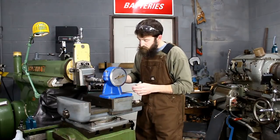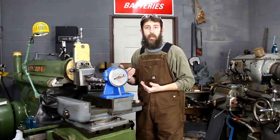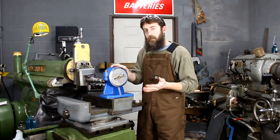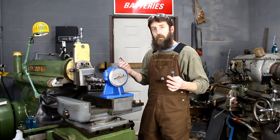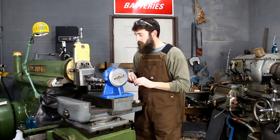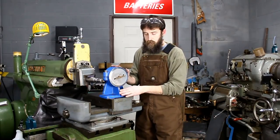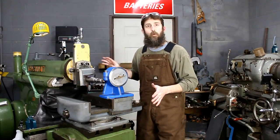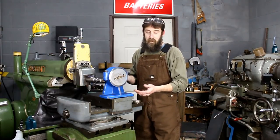I need a way to mount it to the surface. On this casting there's a web in the center that would be a really good place to mount it, but as cast it's a rough surface. I want to make it more accurate — I want this piece of bronze to have a solid base to mount to. It's a 25-degree angle, or really close to that, and I'm going to dial in this shaper to cut this angle. I'll discuss a couple of ways to do that, settle on one, and then cut it.